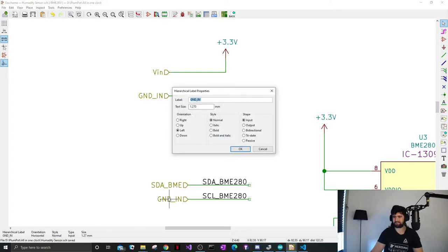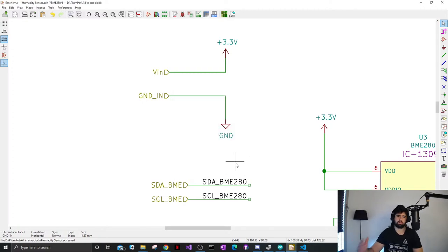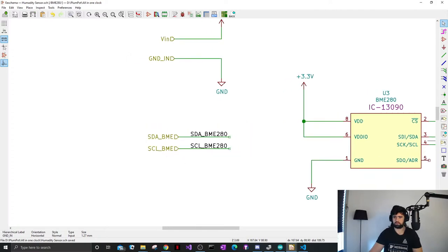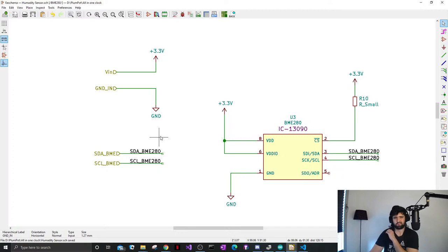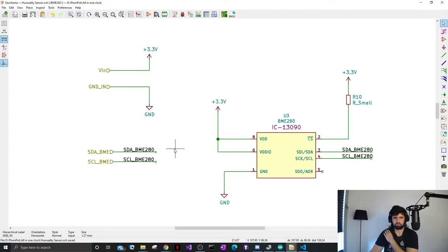No, there's never time for simulating. Yeah, definitely. But also, you'll only simulate if it's a kind of new concept. If it's done before and your colleagues have done it, or your boss has done it, or you have some people reviewing the circuit, you don't always simulate. Net is a net. I'm not understanding. Net is a net. But the most mistakes you can make is on your schematic. Because if your schematic is correct, then layout wise, it should be functionally workable, though not always optimal with EMI and RF and all that stuff.